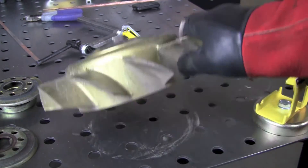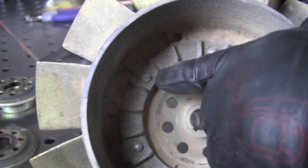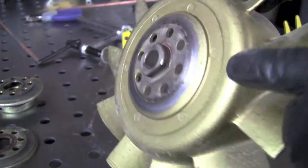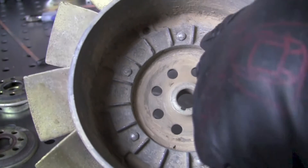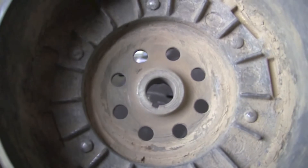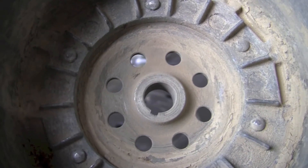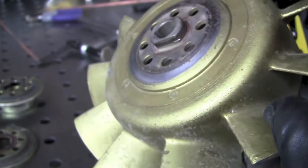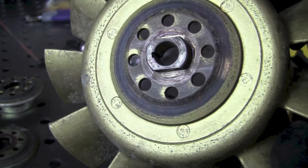Let's take a quick look at how the part is actually made. There are a number of rivets inside the part that can be seen on the outside. What's happened here is there's a steel inner core that has the shaft and the keyway located in the center of it, and then the outside is either aluminum or some kind of magnesium type material.